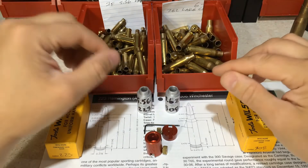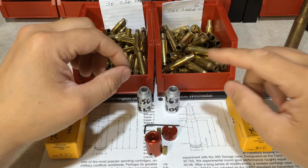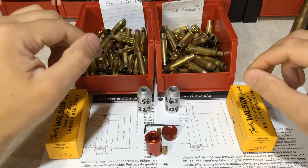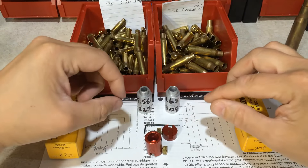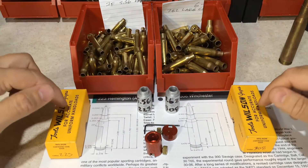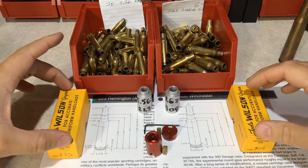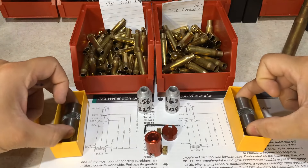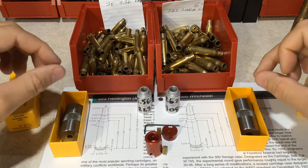This is probably the most important issue when it comes to reloading your ammunition — headspace. Two popular tools used for measuring headspace are Wilson case gauges and bump gauges, like this Hornady headspace gauge that you clamp on your calipers. Whether it's Hornady or Sinclair, they're pretty much the same. Although I still use the Wilson case gauges, and I got them when I first started, they're nice. But I typically use them when I'm using the progressive nature of my press, which is pretty rare. I only use the progressive nature of my press typically when I'm making pistol ammunition.